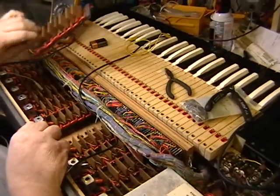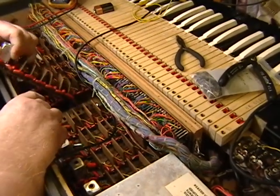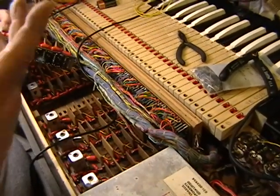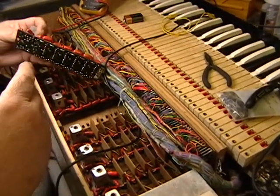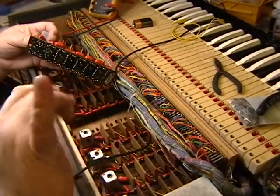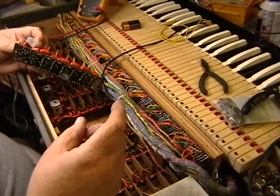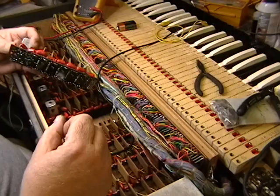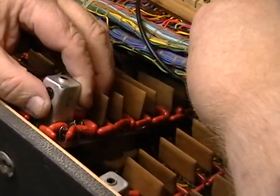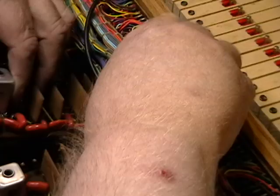Let's see — the next one that doesn't run. Because you even checked the transistors and you had junctions on both of them, which would have proved correct if you just took it at face value. If you look for the two junctions, it's there, and it runs at nine volts. Since beta times IB equals IC, to get enough current to oscillate and go back and forth as a flip-flop, you need a high enough IC and a high enough IB. At the lower voltage — six — you probably don't have enough. And when you have a chain of flip-flops, if number five doesn't go, number six isn't going to wake up for you.